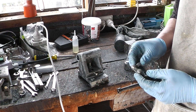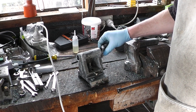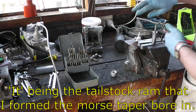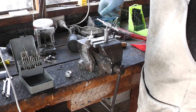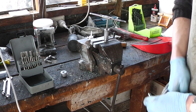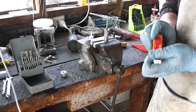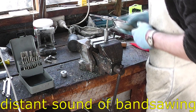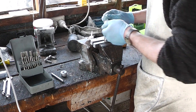You may recall this handle I cast quite a while ago and said it would come in useful — this is what it'll come in useful for. The book says to tap it as deep as it'll go. It did go all the way through. I'm also going to need some M10 threaded rod. The thought occurs to me — maybe cut this to length before I need it so I don't have to sit there waiting for the bandsaw.